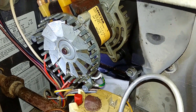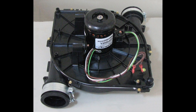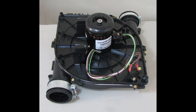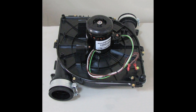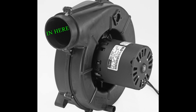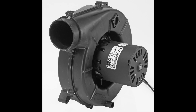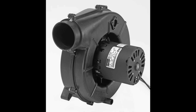It's really not starting — the bearings are gone. Typically I'd say we can probably get about 80 percent of them to at least go temporarily for a day or two by oiling them. The other thing to check for is making sure there's nothing stuck in the blower wheel itself. Every once in a while a bird or something else can fall down into where the blower wheel is and prevent it from turning. But most of the time the bearings have just failed and you need to get a replacement combustion blower or draft inducer.